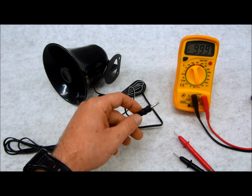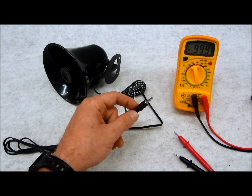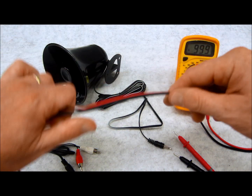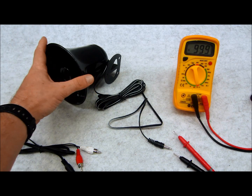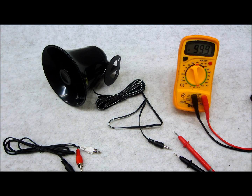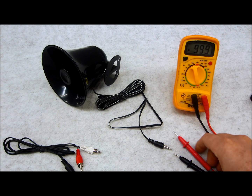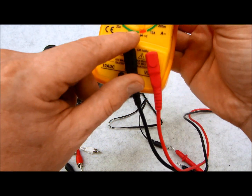Here's what I'd suggest. Take this PA speaker which has a 1/8 inch jack — say I want to connect it to a standard radio amplifier output, which is just two wires like this speaker wire. First thing you need to know is the phasing of the speaker: which is positive, which is negative. You want your speakers in correct phasing. Don't just do it using the pray-and-hope method — you want to know for sure how it's being done properly.